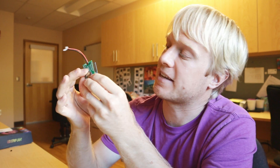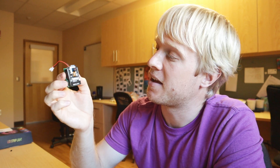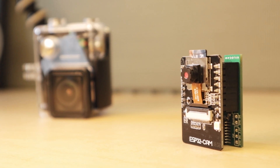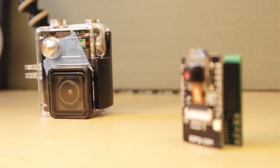So let's say you wanted to do some super intense habitat monitoring and take one photo every hour — way more photos than you actually need to get that job done. How long would a KeloCam run? Well, including the board on the front and the KeloCam board on the back, and based on a 750 mAh battery — which is pretty small, the same batteries I use to power the CoralCam PCB — KeloCam will do that job, one photo every hour, for over 100 days. These are crude back-of-the-envelope calculations, but that is incredible, especially when you consider that the same task, taking one photo every hour, a CoralCam would only last about 14 days, because it's not the use case CoralCam was designed for.